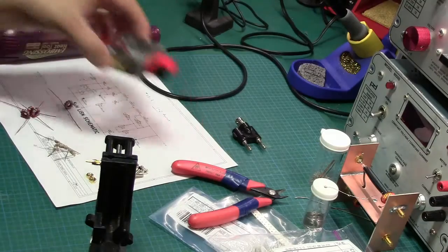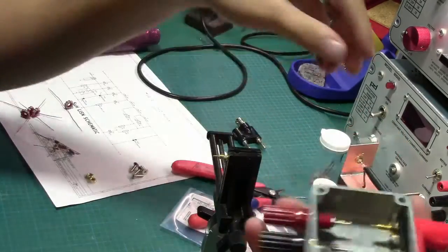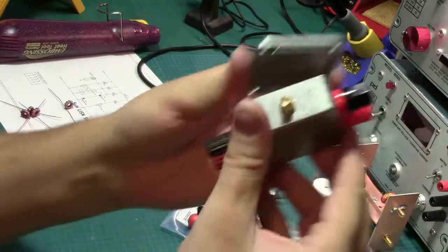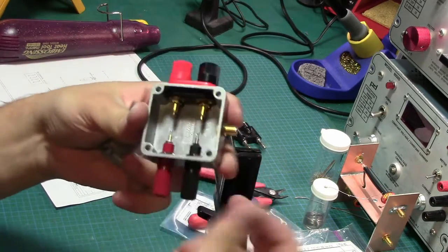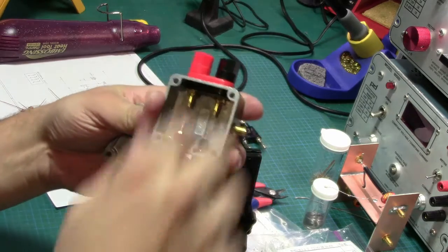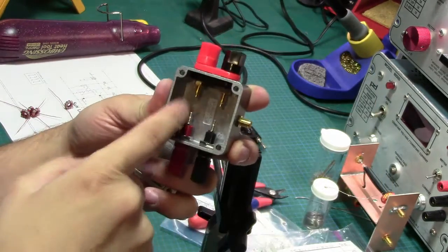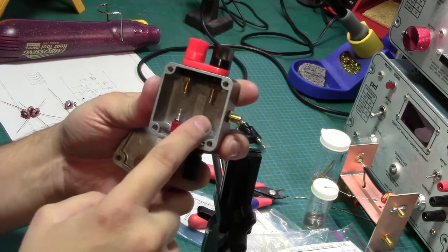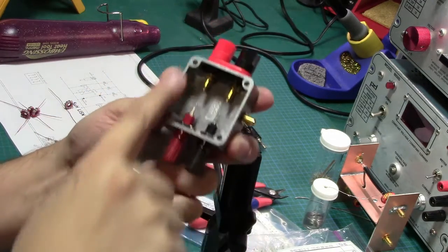All right, we're a bit further along now. So this is what I'm going to actually build this little device in. Okay, this would be good. So, of course, the idea is you've got power in on one of these things, and then your DUT is connected to the other side. So these bus bars will be connected together. The ground is going to be solid, and I'm going to solder it into the case here, so it's also grounded with a shield here.